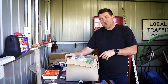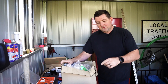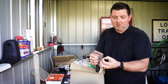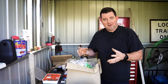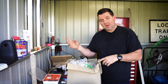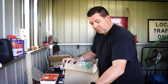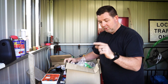The valves I've got in my backyard are a Rainbird DVF solenoid valve — a 25mm female BSP threaded valve. These are the coils that come on them, which are a 24-volt AC coil. I've been running a DC controller, a battery-operated WPX valve which doesn't require mains power. I'm replacing that now with a mains power controller so I don't have to replace batteries. These are three coils that need to be replaced, so I'm going to take the 9-volt coils off and put the 24-volt coils on.